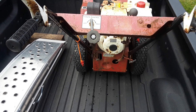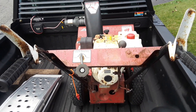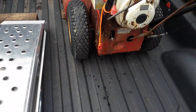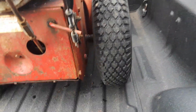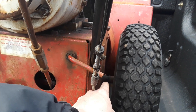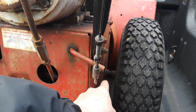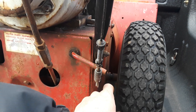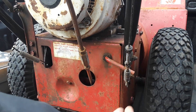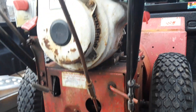Not the prettiest, but the only other thing besides the auger needing to be welded would be that the scraper blade is completely shot - very worn out, the scraper blade would need to be replaced. Would I keep the machine to sell or am I going to part it out for parts? These gearboxes used to go bad on these - if you let that bushing wear out too far the axle would eat into the gearbox, and then that's it. You couldn't put a new bushing in to repair it, and then you'd need a whole new gearbox. To swap that out you would have to buy a whole used gearbox.